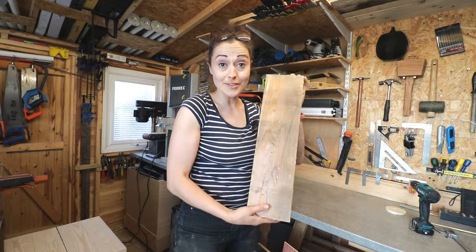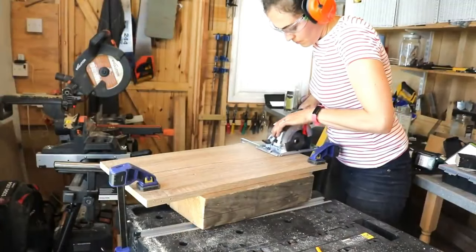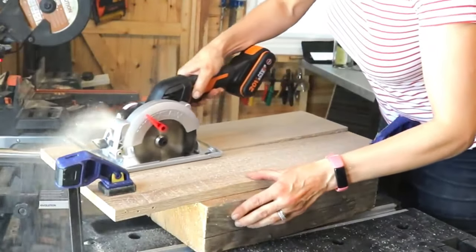When it comes to really chunky pieces of wood, one of my favourite uses for these is to screw a piece of wood down and rip it with a circular saw - that's a nice workaround for not using a table saw.